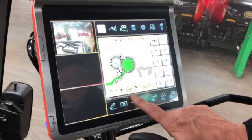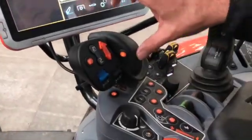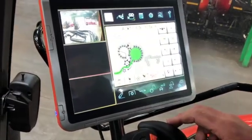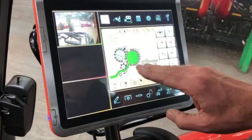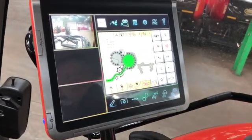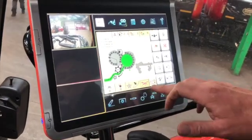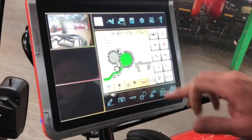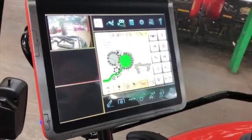From the work screen we are set on the pickup reel, operated by your double-acting spool. If you press that you will operate your drop floor, and as the drop floor goes down the graphic will show you it's down. Then if you press that and operate the same spool, that takes your blades in and out. When the blades are in, the graphic shows the blades in with no red cross. The blades are currently out because they're down and there's a red cross through them.